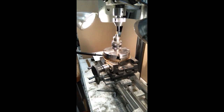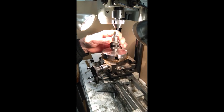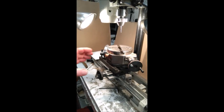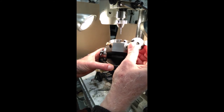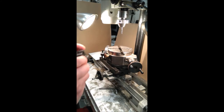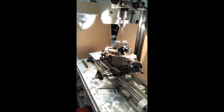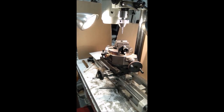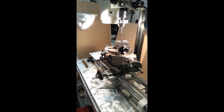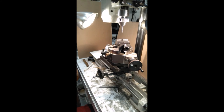The dividing head or division plate is great if you want something uniform, like 30 degrees or 90 degrees. If you want something with some awkward angles in, the rotary table is the tool for the job. Again you can use the drill chuck or the lathe chuck and it screws right on. Now we can move the table round by any amount - one turn of the handle is actually 10 degrees, but it's calibrated so you can turn it another 3.5 degrees if you want, and you finish up with any angle that you'd like. Very useful tool. There's actually a plate on top which has a thread that will hold the chuck. This is the standard thread lathe chuck. This particular rotary table can actually be raised and lowered at a different angle, so you can do sophisticated things like fluted safety valve covers. It normally has a T-slot on, and you can then fix a vice or use the clamps, which is very handy. It's not all beer and skittles though, because it's quite difficult to get the job in the right place with those two slots at right angles - there's a limit to where you can actually put the vice. In many cases I find it's easier to just use the four-jaw chuck and move the job around by manipulating the four jaws.